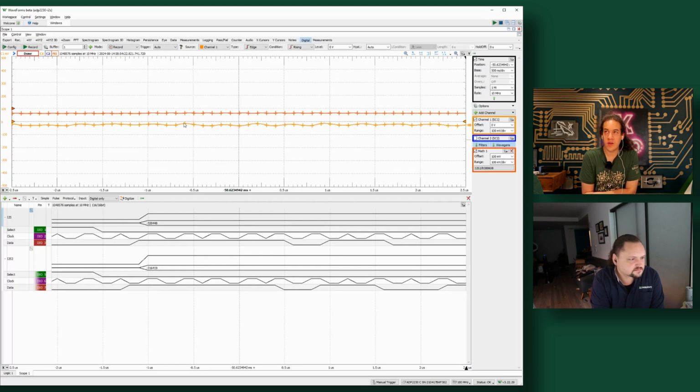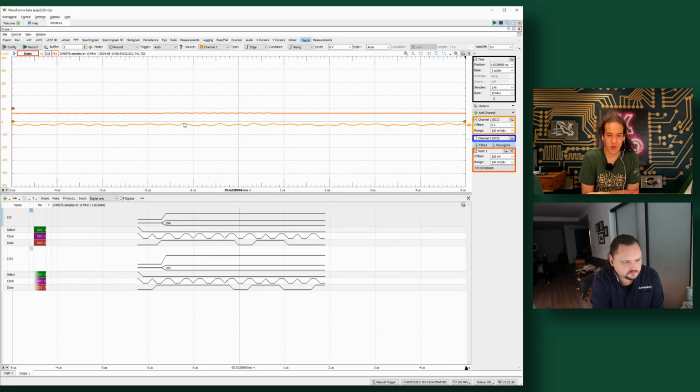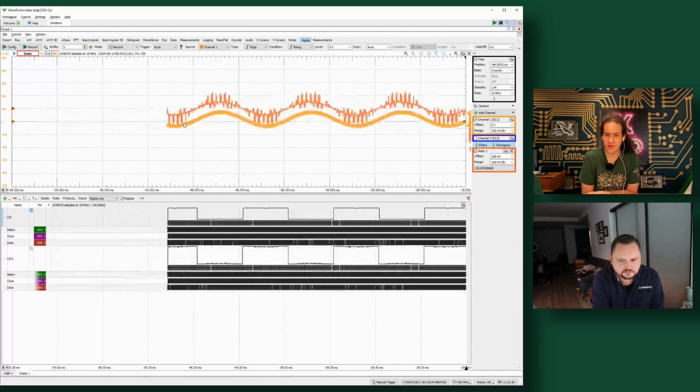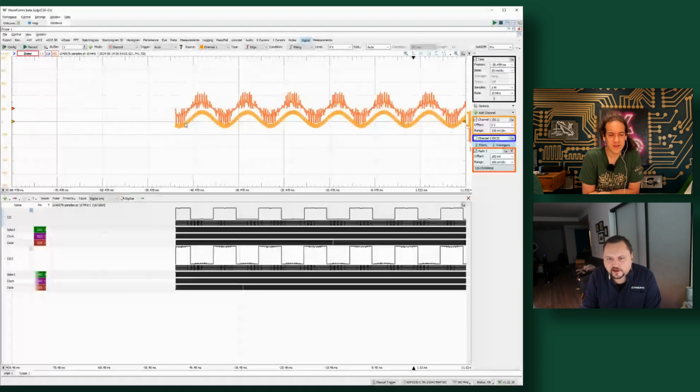What kind of things would you use that level of speed for, say, recording a firmware dump? One example, which showed up in a white paper we put out a while back, is recording the entire boot sequence of a processor booting from flash, every individual byte it reads out of flash as it loads its application from memory. We were booting a Zynq chip, and it was probably a couple hundred milliseconds of SPI data, running at maybe 10 or 25 megahertz SPI clock, just capturing all of it.